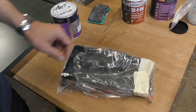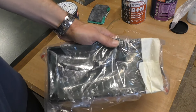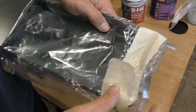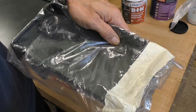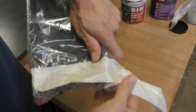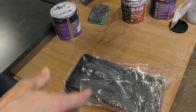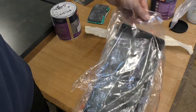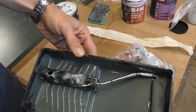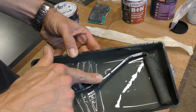When you're mid-job between the first and second coat, I just can't be bothered to wash the roller overnight. I do wash the paintbrushes, but for the roller this is two food bags with masking tape. I used to use duct tape but the problem is gaffer tape rips the bag to pieces, whereas masking tape peels off cleanly — I've actually reused this masking tape. Two bags: one there, one here. My paint is beautifully wet still after two days — all ready for the next coat.